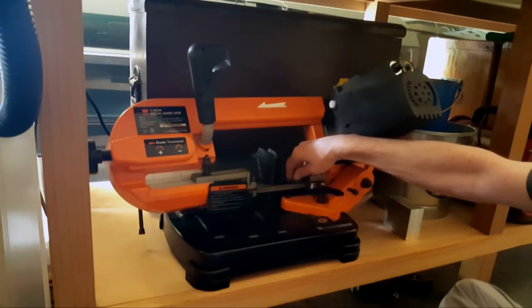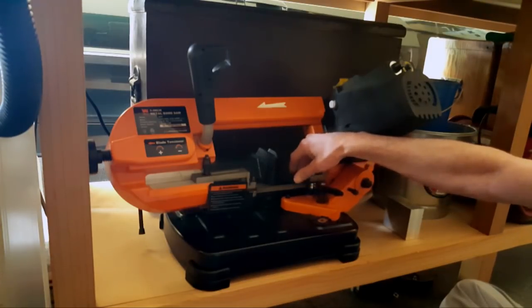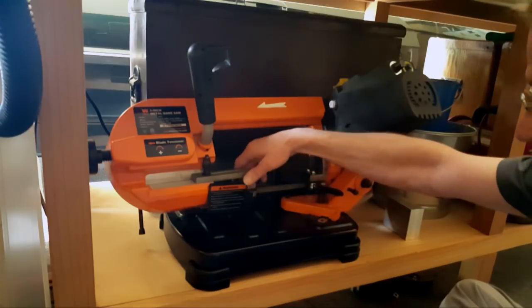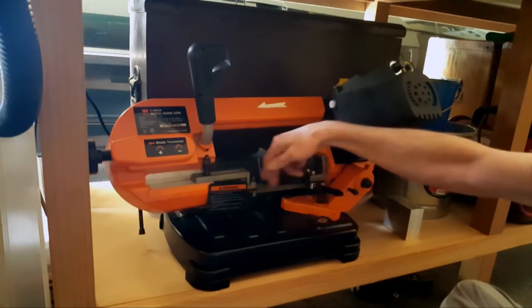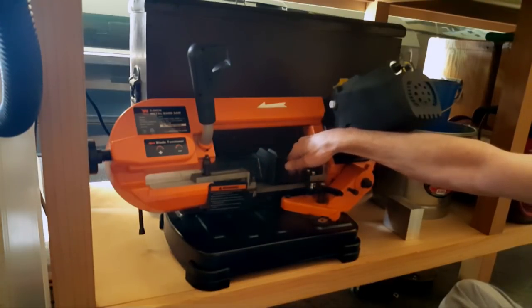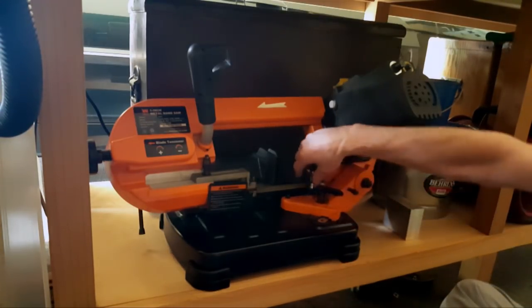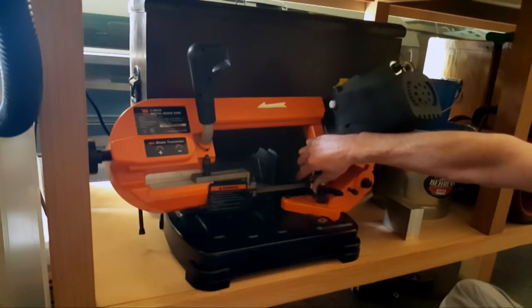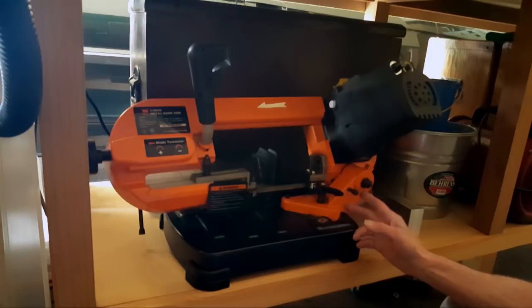As far as the bearings, one video said you just want to adjust them so that they just touch the blade. These, they spin. I don't think you can see it in the video, but if I'm moving this back pulley, the blade's doing this, the same way with this side. The top one here is free spinning. It's not even touching the blade, but the bottom one, when I move it, the blade's moving. So that's kind of where I have them set. I think the front ones are loose too. Oh, they're just barely touching, and I can kind of see the blade moving. So that's where I set that.